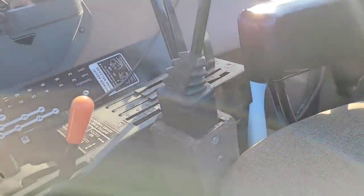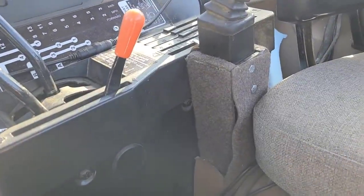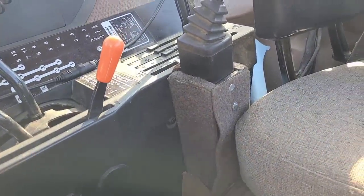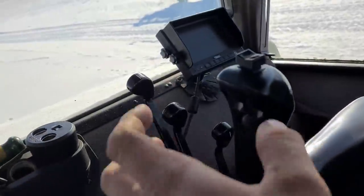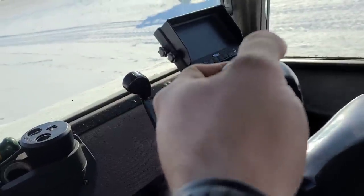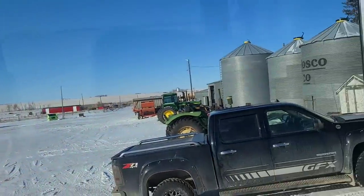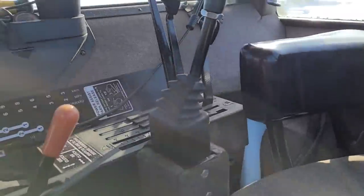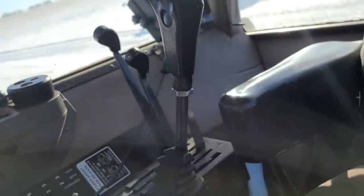Here's the joystick in here. This is the mark one for brackets — I don't like how it turned out, I'm going to be redoing it more like how the other tractors are that I've put them into. But it works anyway. So this one I put a thumb switch in for the grapple fork; the other ones the buttons go in here. And then your cables and wires just run down through the floor and out of the cab.